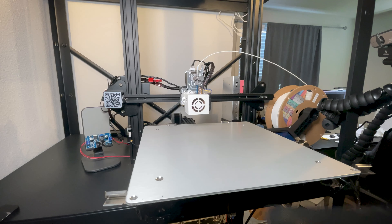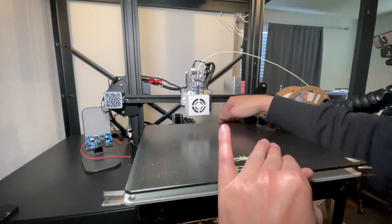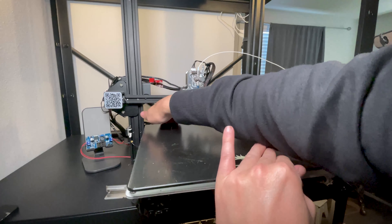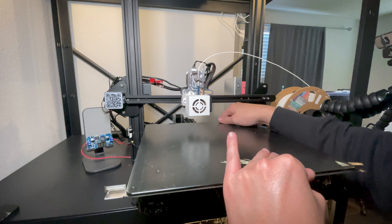If you wanted to go the extra mile, I would highly recommend getting either a removable or a magnetic print bed. That way, you're not moving the print bed itself — you can remove the entire piece, take it off, remove the part, then put back the magnetic or glass print bed without shifting the piece entirely. For example, when I first got my Ender 3, I would inadvertently move my print bed fairly often, causing the LCD to light up pretty frequently. It wasn't until after a period of time that I learned this was actually a bad thing. Since then, I've upgraded all my printers to include a glass bed, with extra glass beds so I can continuously print without wasting time cleaning and swapping.